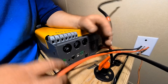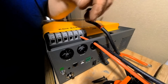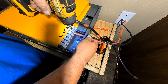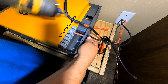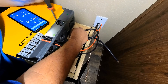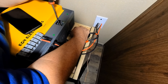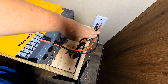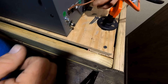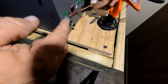The first thing we're going to do is hook up the PV wires. They're clearly labeled on the bottom of the EG4 — PV wires go in here, positive on this side, negative on this side. The positive wire is in — let's get it tightened down real good and snug. The negative's in — let's tighten it down. Power coming from the solar panels is now hooked in. Now let's hook the ground, which goes right here on this little screw. We'll crimp a connector on the wire and get it screwed in.